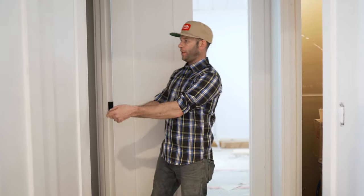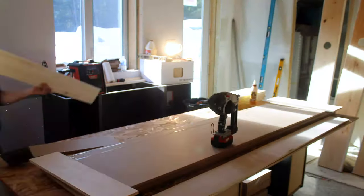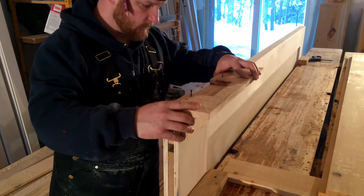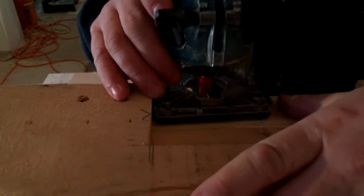When we first started planning this job, we found some excellent doors at a fantastic value. For the doors we were missing — like closets — we figured we'd put in bi-fold louver doors. But after we saw the doors up, they looked really nice. Wouldn't it be nice if we could just match all the doors? So we ended up making nine more doors using sheets of MDF for the main board, with simple ripped plywood along the edge, puttied and sanded. Now we've got all matching doors throughout the home at an excellent value.